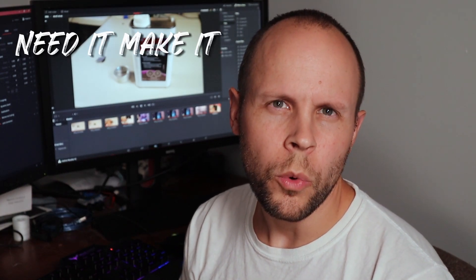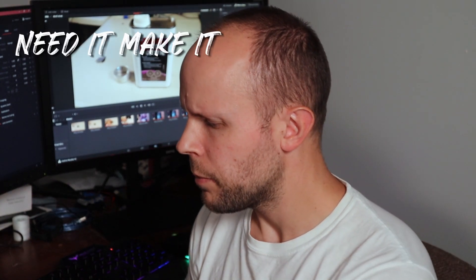Hey, welcome to the show. We are on a quest for the best build plate bond. I did a previous video on this where we tested glue stick on a glass build plate and I have some results from that. We also tested initial layer print speed — 55 versus 20 millimeters per second — to see if that had any impact, and it had very little if any. I've been printing with ABS and glue stick for a while, recently switched over to glass on the build plate, which works great, but I think we can do a little bit better. Today we're going to use your suggestion: ABS slurry or ABS juice, whatever you want to call it, and see how it stacks up. So stick around.